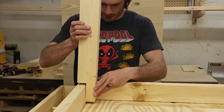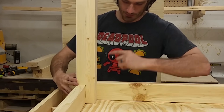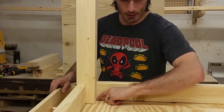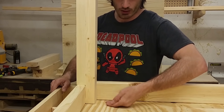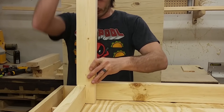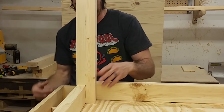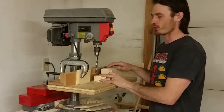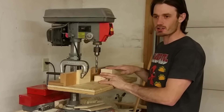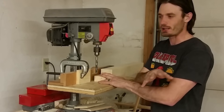With the legs, this is what I decided to do - it's going to sit in here right like this, pulling really tight. I'm going to have two bolts for each leg at kind of a 45 degree angle coming in right here. I decided to leave just a tiny sixteenth of an inch gap because I don't want to push against this surface. I want to reference directly off of this 2x4 because I know it's straight. All of my vertical force is going to be pushing on the 2x4 and my horizontal force is going to be pulling this piece together. I decided to use the drill press because I want a certain amount of repeatability - I'd like these legs to all be interchangeable so I don't have to mark which leg is which.